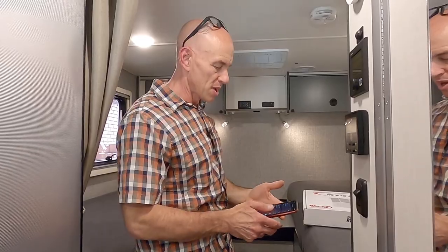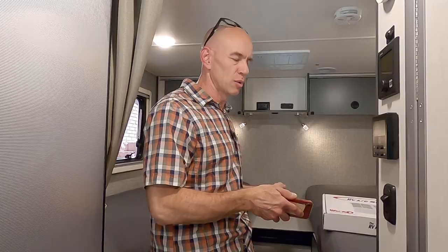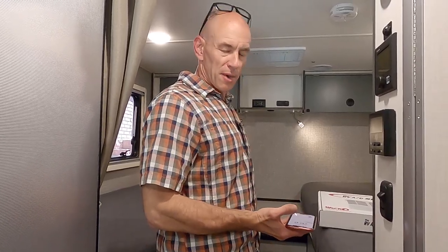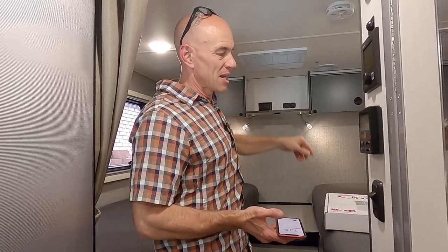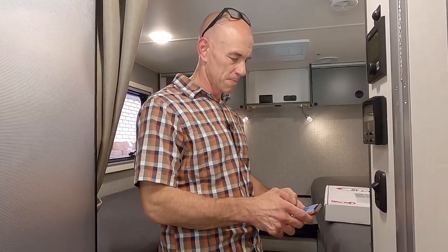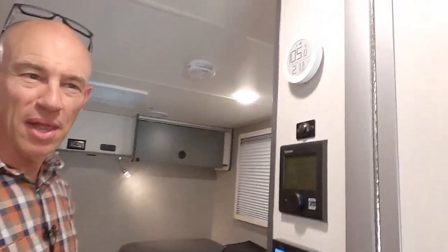Get about arm's length away from the air conditioner. I'm using an iPhone app from the National Institute for Occupational Safety and Health — the NIOSH sound level meter. You have to use A-weighted decibels, which discounts lower frequencies because they're less annoying. Hold the microphone at navel level and point it at the air conditioner. Measure on high cool, full blast, because who cares about anything else — and it's a hundred degrees out, so full blast is appropriate.